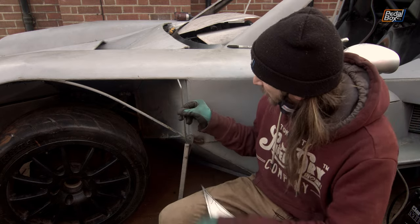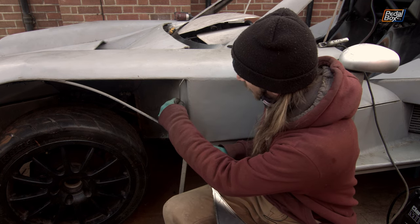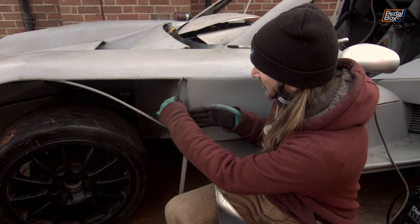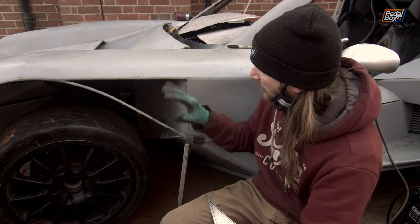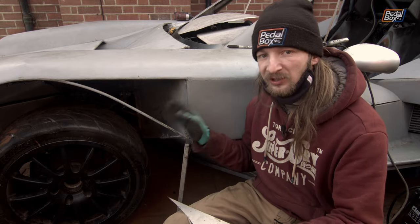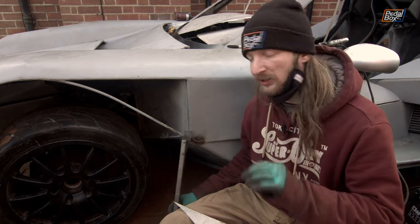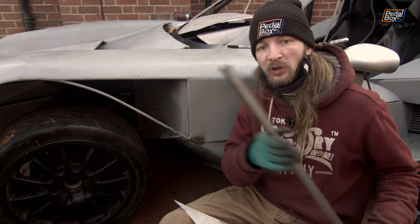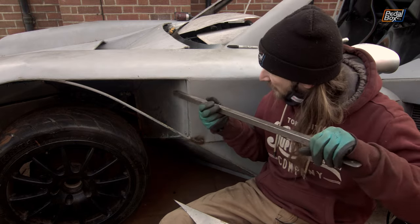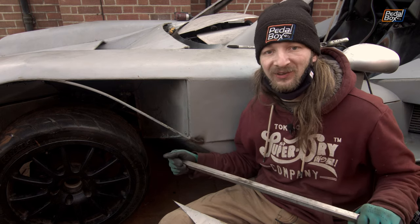Like so many other pieces of metalwork, we're going to start by finishing off the frame — we're going to weld this up so that we've got all three sides of our panel located, then shave it down to match and make sure the vent is definitely less than the 25mm size limit required to get that small allowed radius. We're going to use this piece of 20mm box section and just position the rod right up against it to make sure we get to the right size.